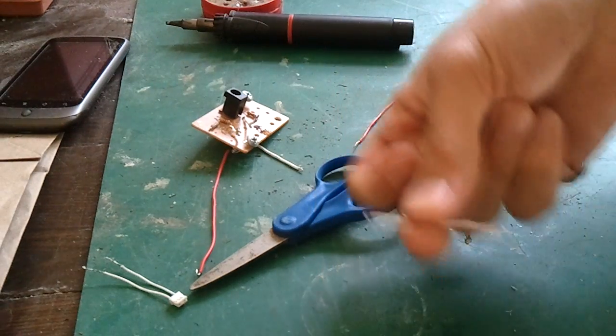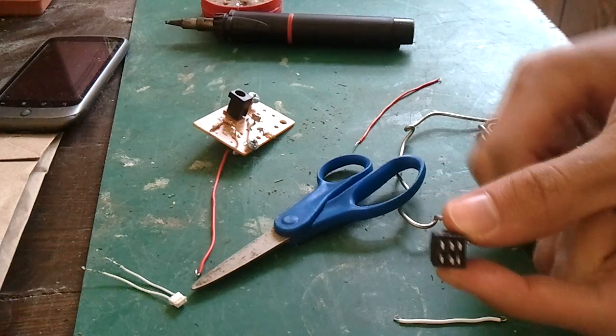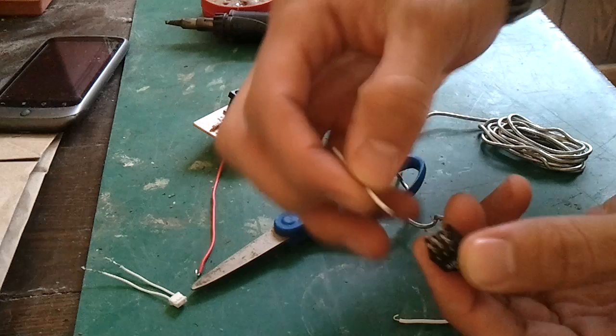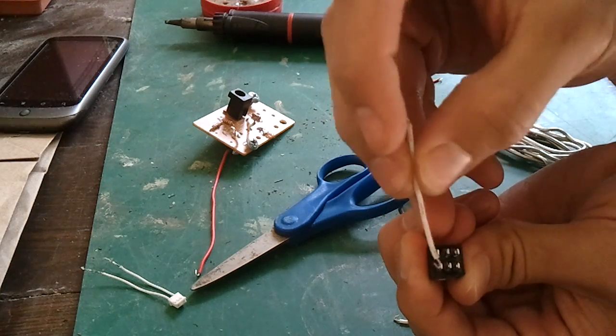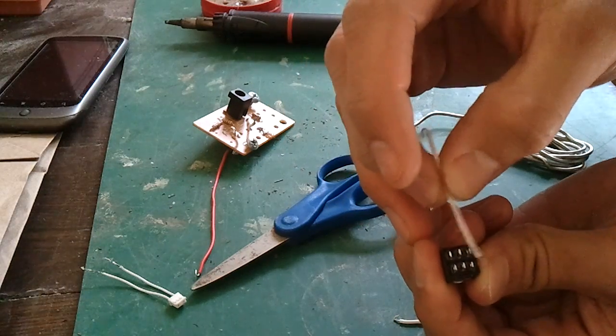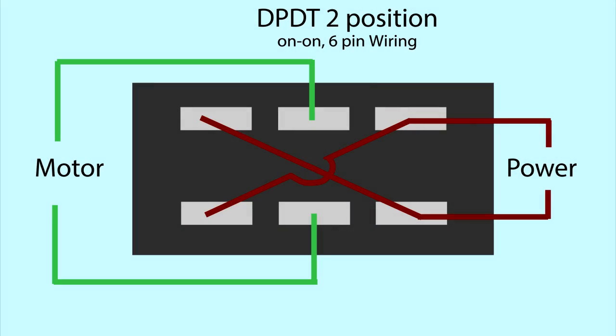The first step is to get some wire. Here I have two pieces of wire, and what I'm going to be doing — you see there's six pins at the bottom of it — I'm going to be putting two pieces of wire on the diagonal, meaning on this one to this one, and this one to this one. I'm also going to be connecting these diagonal switches to my power supply. Here's a diagram I made for you guys to illustrate how you're going to be wiring your DPDT switch. What you see in red is what I'm doing right now — you can see there's two wires crossing each other but not touching. Those wires are also going to be connected to your power supply, and the two center pins are going to be what connect to your motor. If you pay close attention, you'll notice that I actually soldered them in parallel instead of crossing them — I went back and fixed the issue, I just didn't show it on camera.